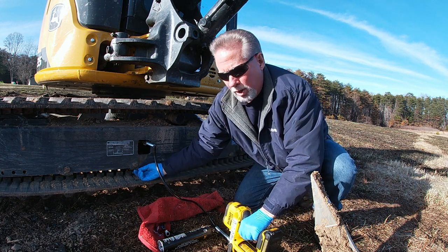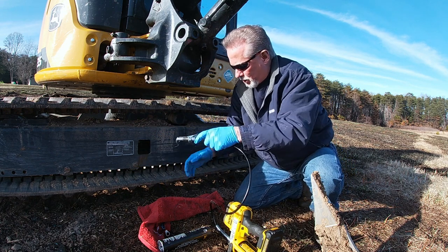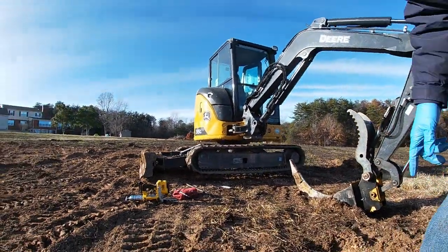You want to go to where about a finger or two is underneath, which is what I've got now, so I am good on this side. The next thing we're going to do is fire it up, run the track around one way, run it back the other way, and then we'll do one more check.